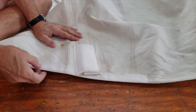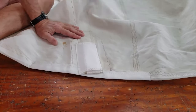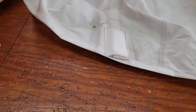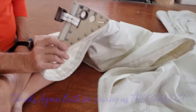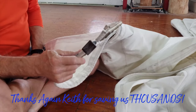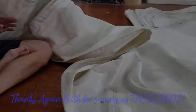A little bit of area was chewed up here, which had to do with the monofilament cord coming up in through here. So I put a new piece of folded three-inch there, of course when the pocket was up. The last thing I did was new webbing on the headboard slide - I just do it as a matter of practice. This one takes a lot of load and gets a lot of UV, so I always do it. It only takes a moment.